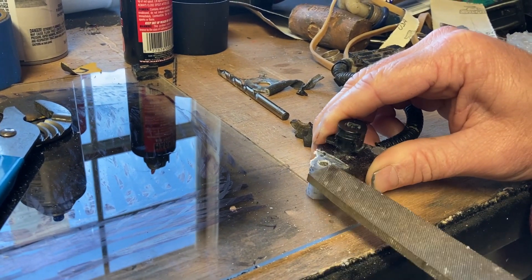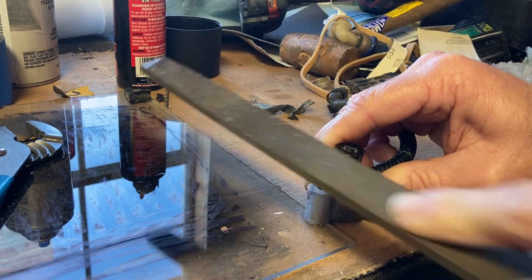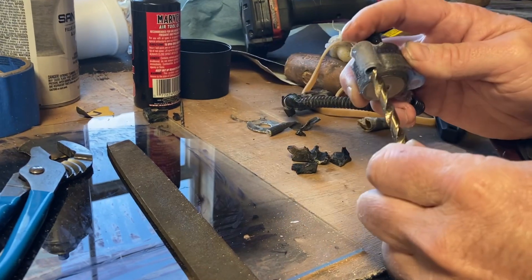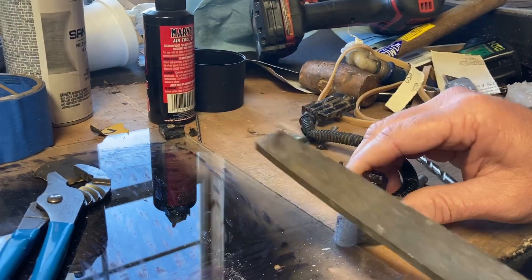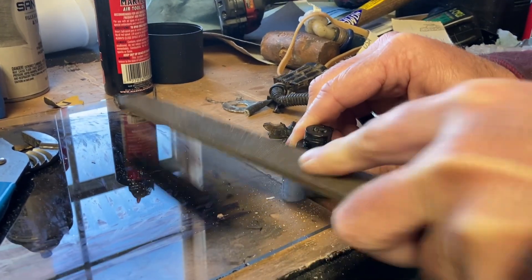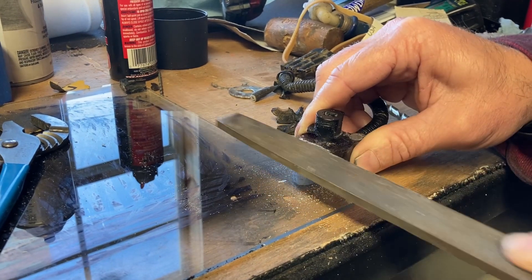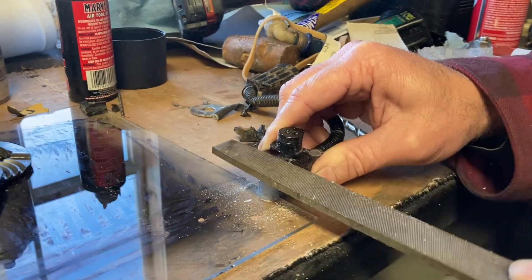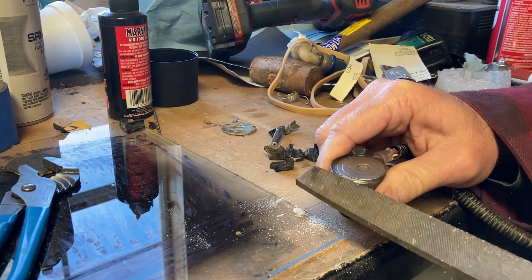You can put it on a piece of metal or anything to level it out, then file the epoxy down to where you start hitting the metal — now we know the metal is flush. I'm going to push the metal out so they're flush. I'm going to take the epoxy down a little past that so I'm absolutely sure all the pressure is going to be on the metal insert rather than the ear.